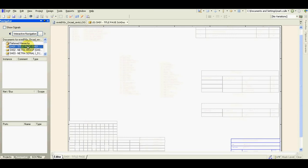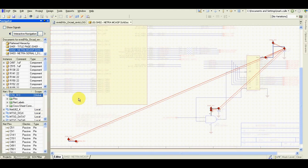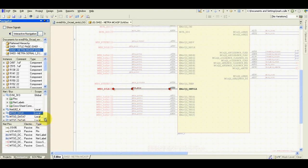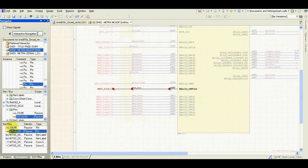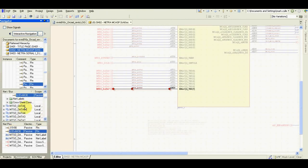A practical example: the first page has no components, no nets, no pins connected. On the second page, I select the first net on the list — this is actually a power net, so I'll select a simpler net instead. When checking this net, it's connected to this clock and also to this connector — those two pins are all the pins where the net is connected. Moving to the next net, it's connected to the connector and our CPU.